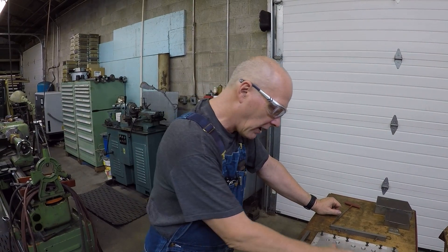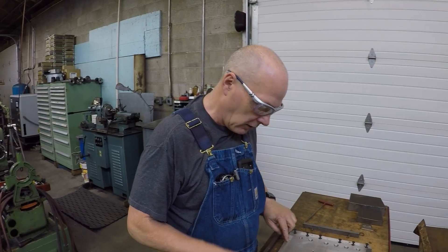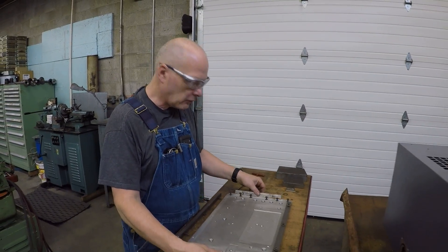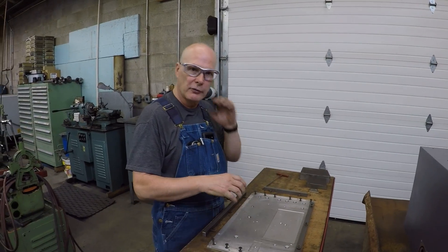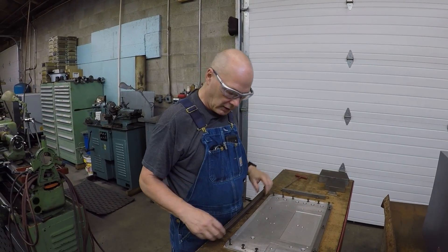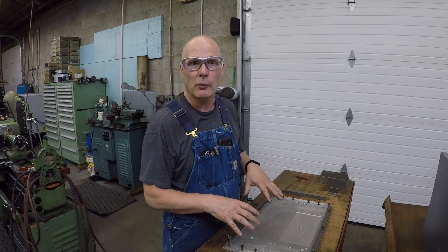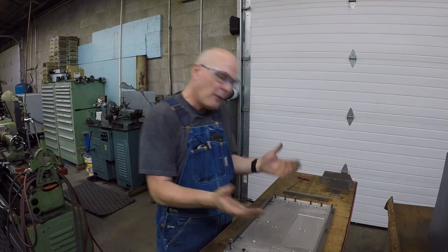When you talk about stabilizing, you'll notice I don't just put screws in and tighten it down — I have the whole bar to spread the clamping pressure as far as it'll go. You want to go as far as you can while keeping it out of the way of the machining. You want to crowd it and get as much done as you can without changing anything.